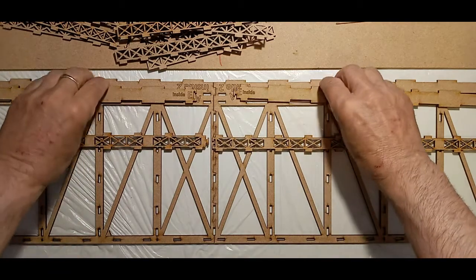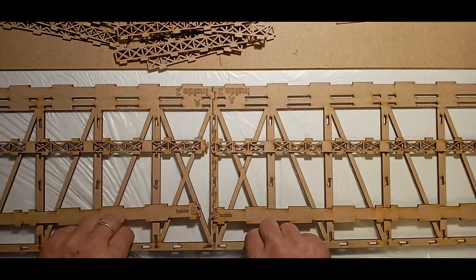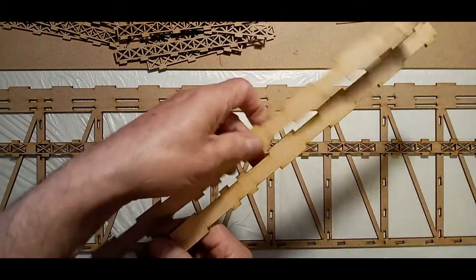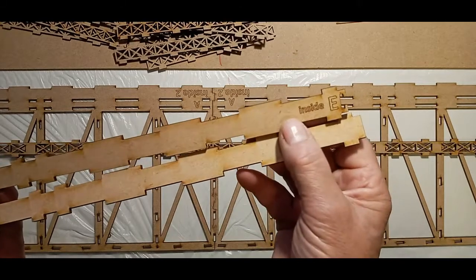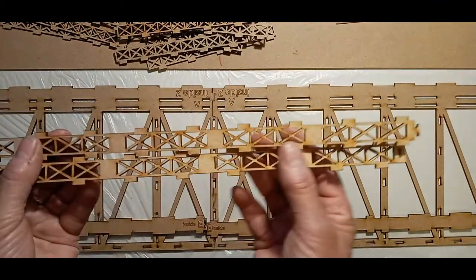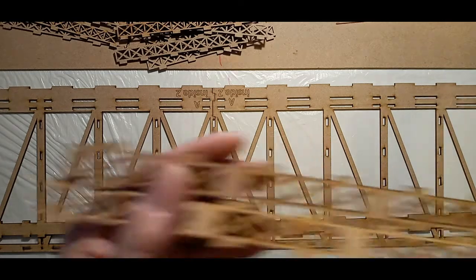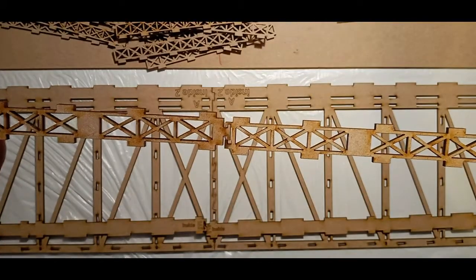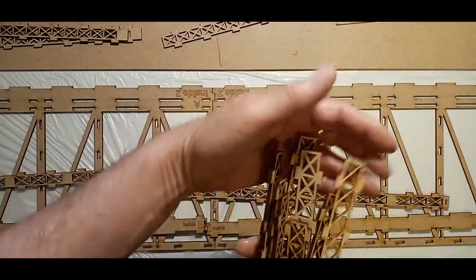Right, for the next section, which is putting the two halves or two skins together to make up one half of the bridge, you will need one of the sections you've already glued together, in this case A inside 2, as labelled there. You'll need two long straight ones, which are labelled E inside and E inside. You'll need two long perforated strips. These aren't labelled as such, apart from the word they have, the word down or DWN added at each end. Obviously pick a pair that will join in the middle. You will then need 11 short ones, as I call them.